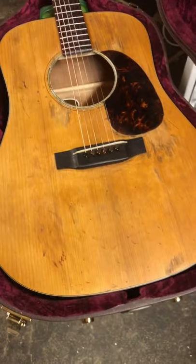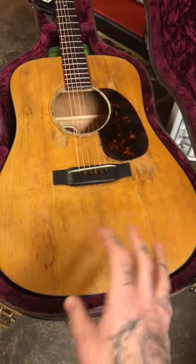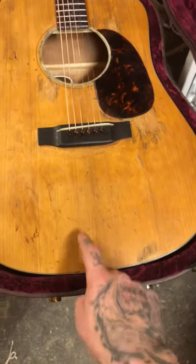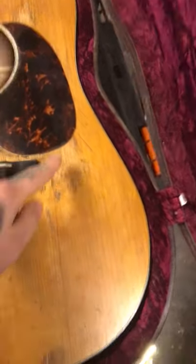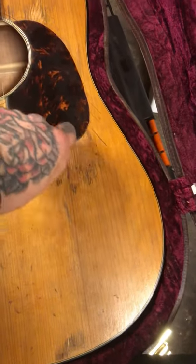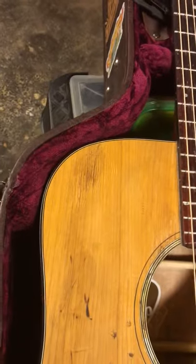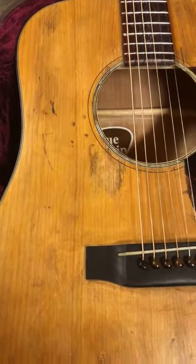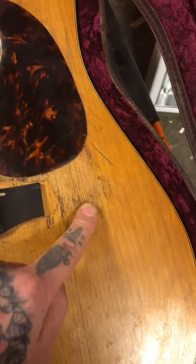I used an amber tone burst — that's what gives it that antique yellowish look. Then I used furniture wax, quite dense, and then used a knife — a food knife — to scrape here and also here and here, for some minor wear marks. You can use keys as well, like your home keys. Then I rubbed wax into those areas.